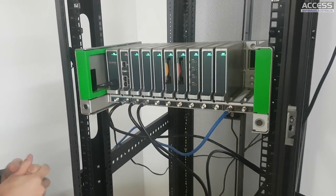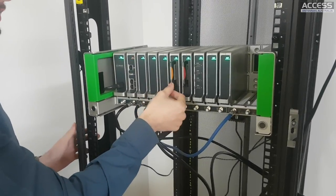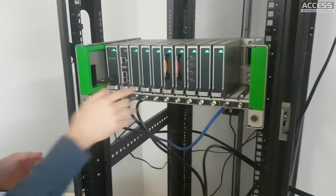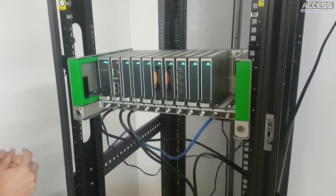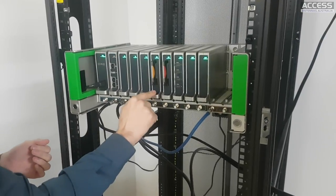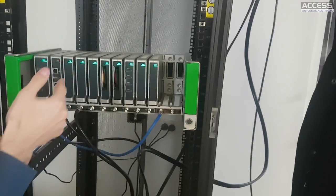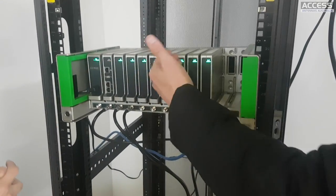Right now we have Foxtel CAMs. With Foxtel we can decrypt up to four services per CAM, so with each SEC module we should be able to handle eight services. This SEC module is also responsible for re-encrypting services. Each SEC module can decrypt eight services and encrypt 32 services - it can do both. If you want more than 64, you use three SEC modules.